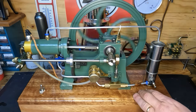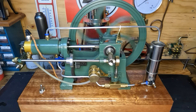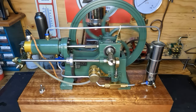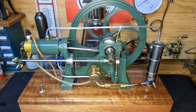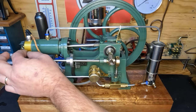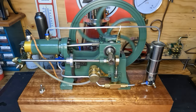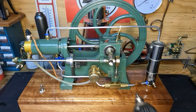I've probably flooded it. I'll pinch this back and close it all the way so it can't get fuel. We do have a wet foam, so I'm sure I've flooded the tar out of it. I guess I'll put the drill start attachment on it and wing it over — it should take off pretty easily.